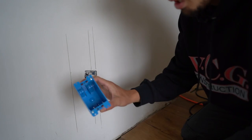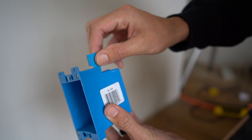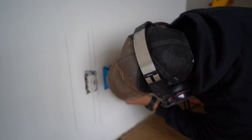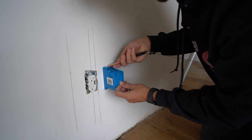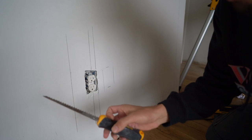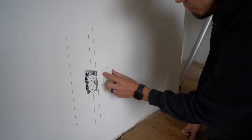This is a remodel box — it has these toggle bolts on it, these wings that grab the drywall. I'll figure out how far to put it — about right there looks like a good enough reveal — then I'll roughly mark this and outline it so I know what to cut with my drywall tool. Before I cut, I want to pry this off and see how much slack I'm working with, because I don't know if I can even move it that far yet.